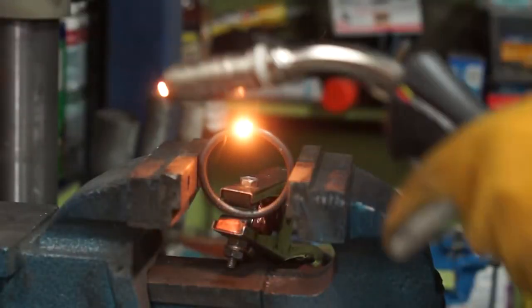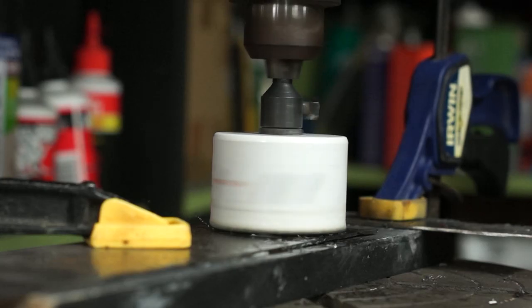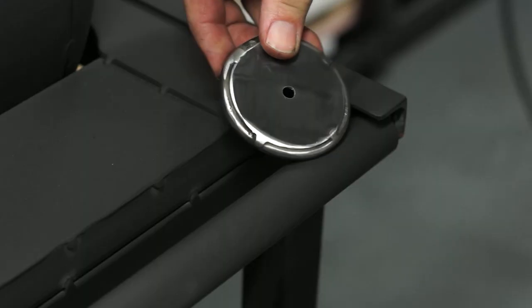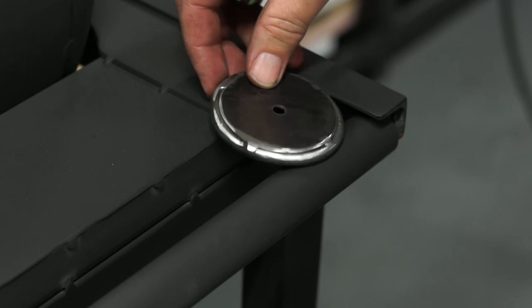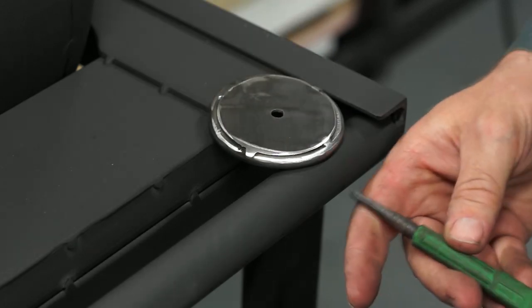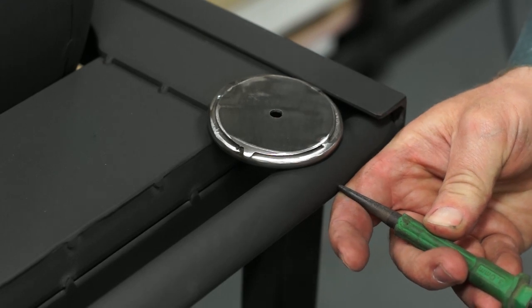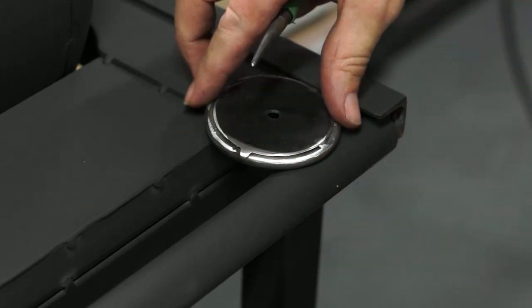The sliding tool rest will be handy for balancing longer pieces of iron, and I've set the distance of the rails so most of my hammer handles fit through the gap and hang on the hammer heads. I made up a simple handle for tightening up the tool rest, welded a bolt into the center and a nut onto the rail that the handle threads into.